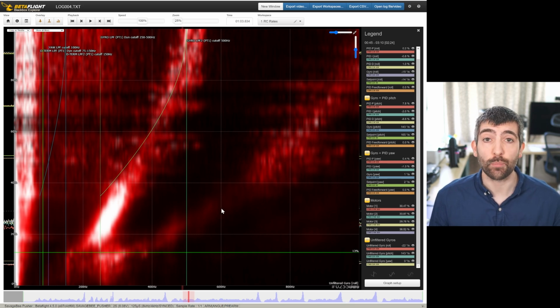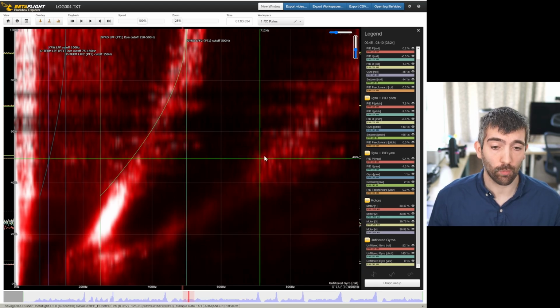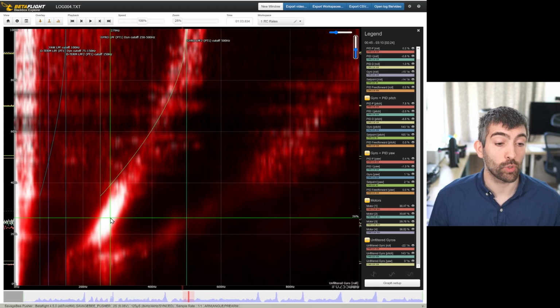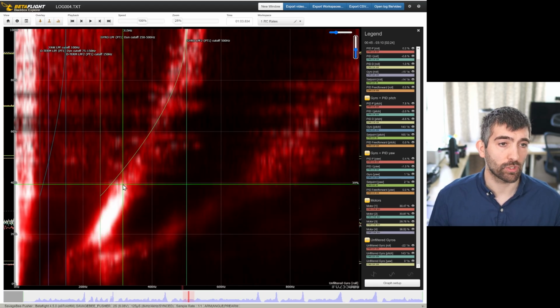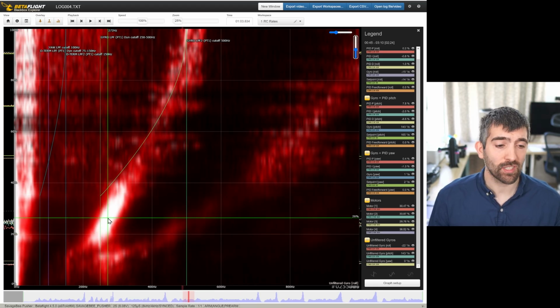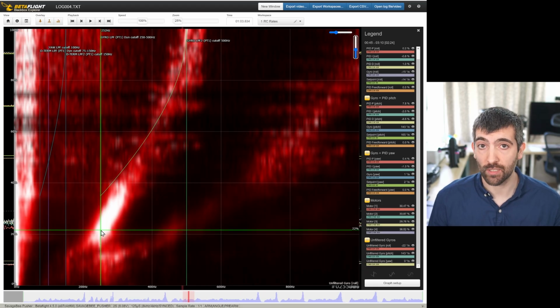It's a very small frame, so we wouldn't expect there to be too much vibration. You can see we've got 2 bands of motor noise here, which are due to the bi-blade props that we're using, and that we do have the most noise power at around the 250 hertz level, anywhere from about 230 up to about 300 hertz. So there might be a frame resonance in here, and certainly from the D term trilling that we were seeing in the logs, that could indicate that when the throttle position is just hitting that frame resonance, we're getting that D term trilling because there's not enough D term filtering, or the D term is too high.